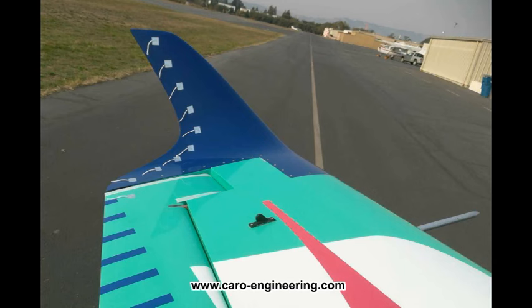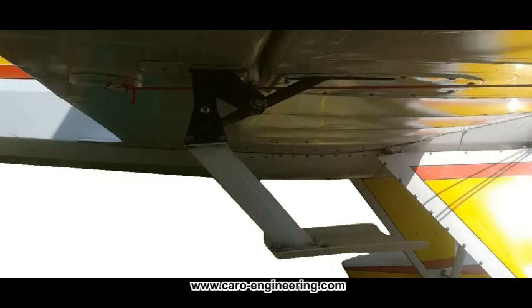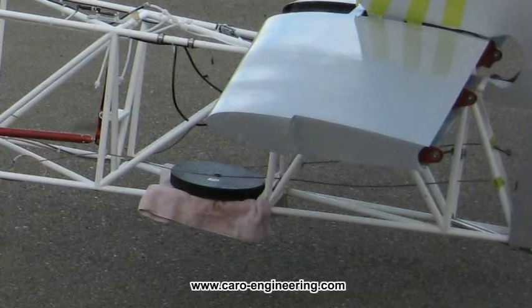If there is a lot of friction in the system, to overcome it, the pilot must apply extra force to move the controls. Friction also prevents the controls from returning exactly to their neutral or trim position. If a control system has a lot of play, it feels sloppy to the pilot, and in the worst cases, this increases the workload, makes the airplane more difficult to fly, and could lead to flutter.